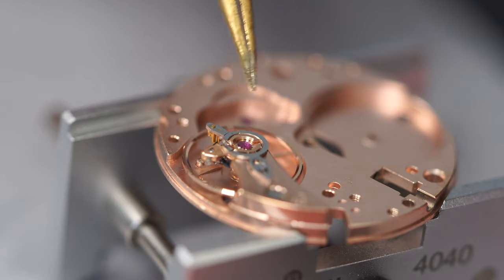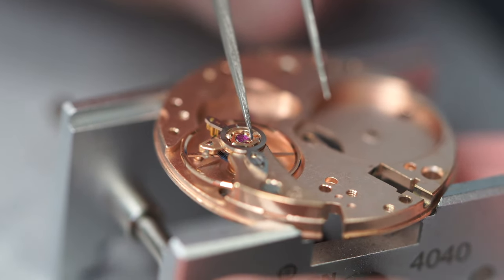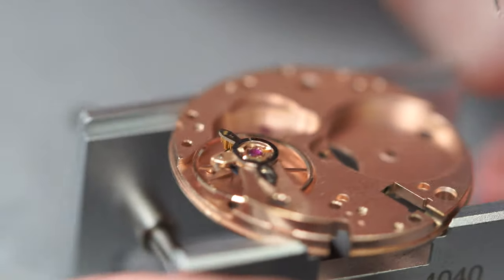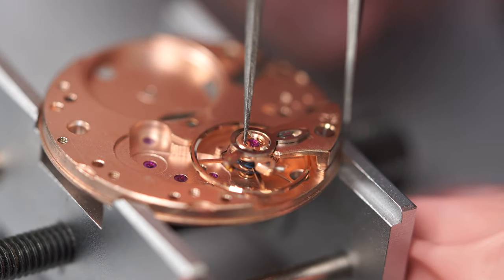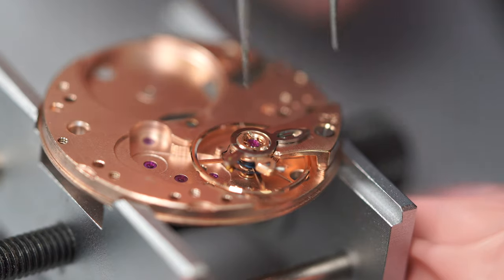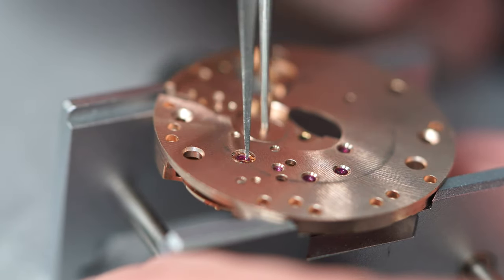Oiling all the jewels, then placing it back in the balance and closing the spring on top. There are two little arms - you just need to close them with tweezers, one side first so one arm goes underneath. There we go, going underneath, then doing the same on the other side with the other arm. The jewel is now secured.